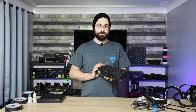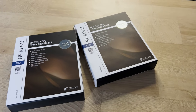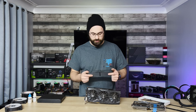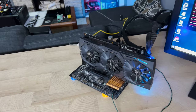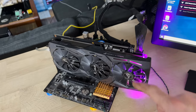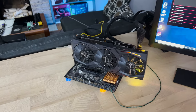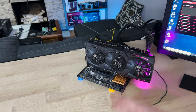I have an RX 580 here because it's the most accessible card I had. We will first overclock it to get some extra heat output, then mount two Noctua slim 15 millimeter thick fans and look at the thermal differences — and maybe acoustic differences, though my space has a fairly high sound floor. Before any comparative testing though, I want to make sure this heat sink is absorbing heat as efficiently as possible, so we're going to pop this open and replace the thermal interface material, check the thermal pads, and replace the thermal paste.